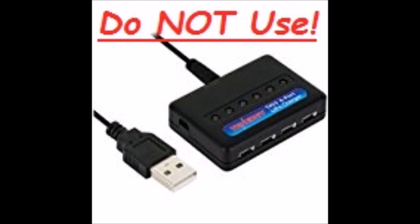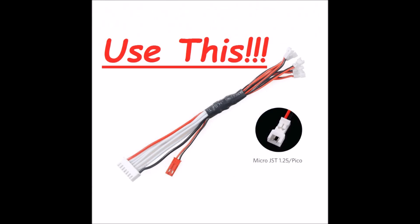So if one of your batteries is almost empty and the other two are half capacity, you probably don't want your charger to provide the same amount of power to each of them. The key is to use something called a balance or serial charger, and until recently you were forced to build these cables yourself, but not anymore. These chargers look at every cell individually and then provide the appropriate amount of power to each one of them.